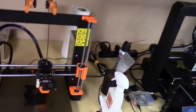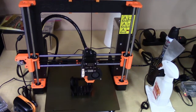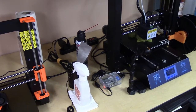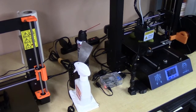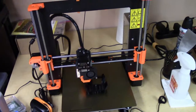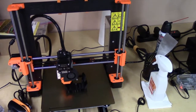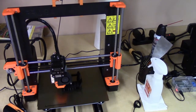Because this Prusa, which is amazing, I can print ABS all day on it, no problems. That one can't right now because when they upgraded to the Ultra Base, they thinned out the aluminum. It'll get to 105. It'll bounce between 105 and 100, but I think it's dissipating really quickly. I've had parts pop off constantly. This thing is a monster for printing ABS. Never had a misprint yet, and I love doing all my solid parts. I want to do an A-Net soon, and I just bought some ABS filament to do all the upgrades on that, since I want to build my own printer.